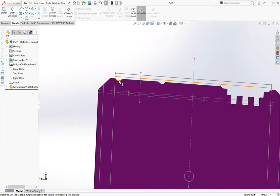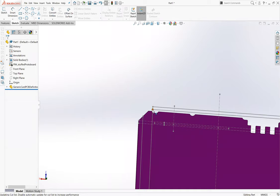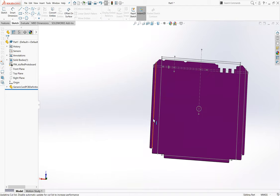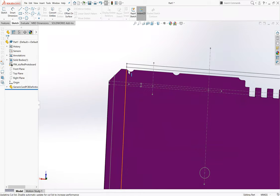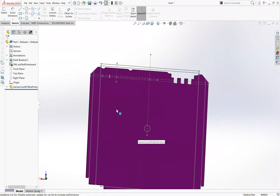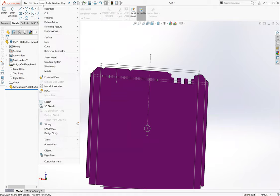The same logic applies for these other cutouts: there are some fasteners that keep the back plane attached to the frame, and these cutouts are there in case our card is at the same location as one of those fasteners - you don't want it to hit. There are also some notes mostly for the DXF portion. From this line to this line is where there would be exposed copper, and these are build limits for whoever is making the card.